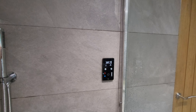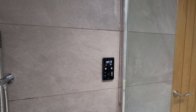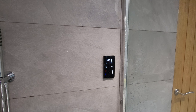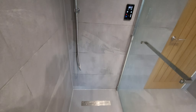A quick overview of the system first. We've got a rainforest head there, a separate shower head, and the control unit. The control unit is married to a 34 kilowatt combi boiler, or about 120,000 BTU boiler. It's a high pressure system, fed from the mains, and it works absolutely perfectly. All that's built into a lovely little walk-in shower enclosure.